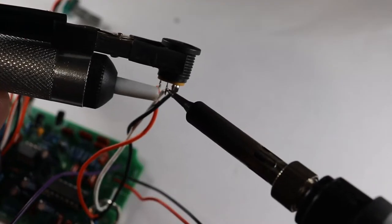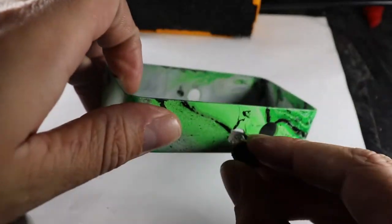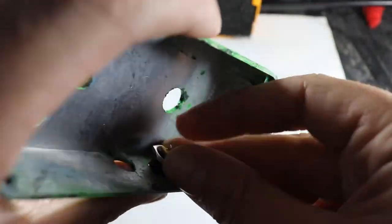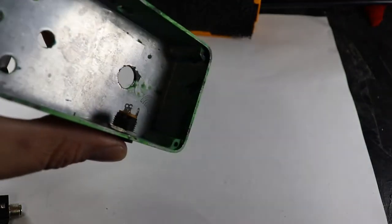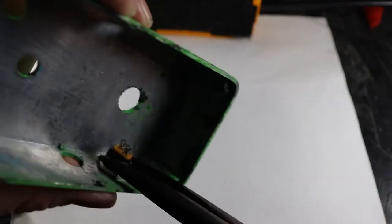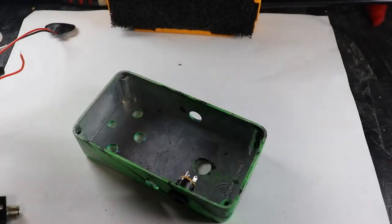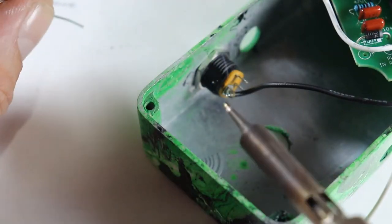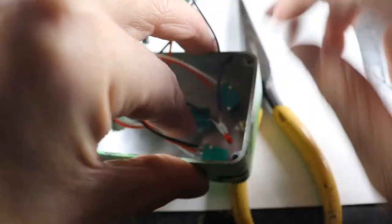I have to get our old pal, the solder sucker, involved once more, remove as much solder as I can, and try to remove the three wires cleanly, considering that the nut goes on the inside of the enclosure. I should have attached it to the box before I soldered on the wires, which is definitely more difficult, but in this case, our only choice. Some additional solder sucking might be needed to clear the holes in the contacts again. It's possible to reattach them without holes, but I am a noob.